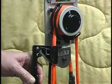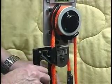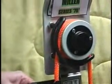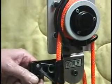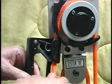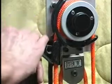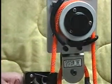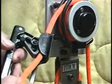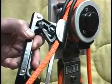This handle does not lock open, which you would not want with a system like this, as it could fall off the rope. To use it, you slide the handle up the rope to the drum. Hold below the rope loop with one hand and slide the handle with the other. Then with two hands you pull down — notice the drum turning. When you want to do another lifting stroke, slide the handle up; notice how the rope travel lever opens slightly.